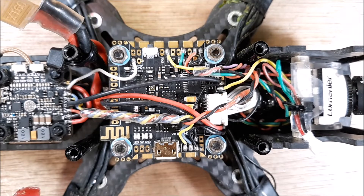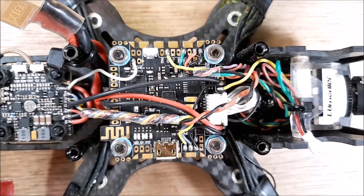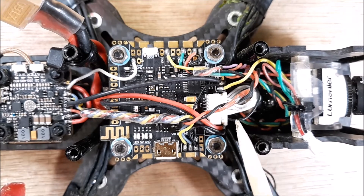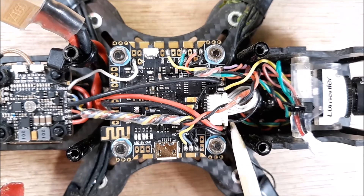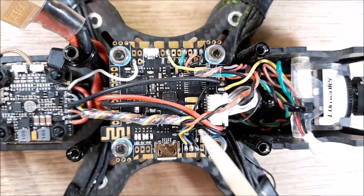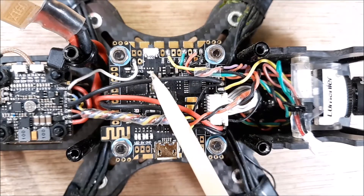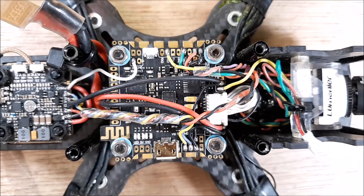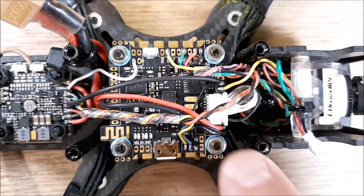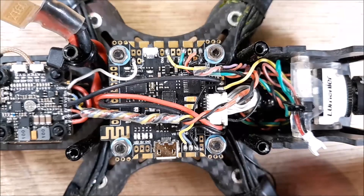That's how I've corrected it on this one and on my race quad — no more issues. I am going to do a video on how to get even better video quality by isolating the VTX, so stay tuned for that. Basically I have a ground from the VTX up to the flight controller, and a redundant ground coming from the battery — over to here, over to here, from here over to here. Don't worry about the extra one unless you've isolated your VTX. I hope this video helped you out. If it did, give me a thumbs up and subscribe!